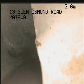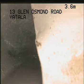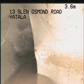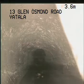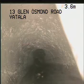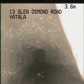I've just re-camerared the drain from the IOS at the bottom of the stairs at the lower portion of the back lawn, the retaining wall. I've worked back up a step down, and I've actually just hit this at 3.6 meters, which isn't far from where you can see further down — that's where that initial root intrusion was. This is about 500 millimeters from that retaining wall toward the front of the home, and it's pretty well in line with the right hand side of the steps coming down.